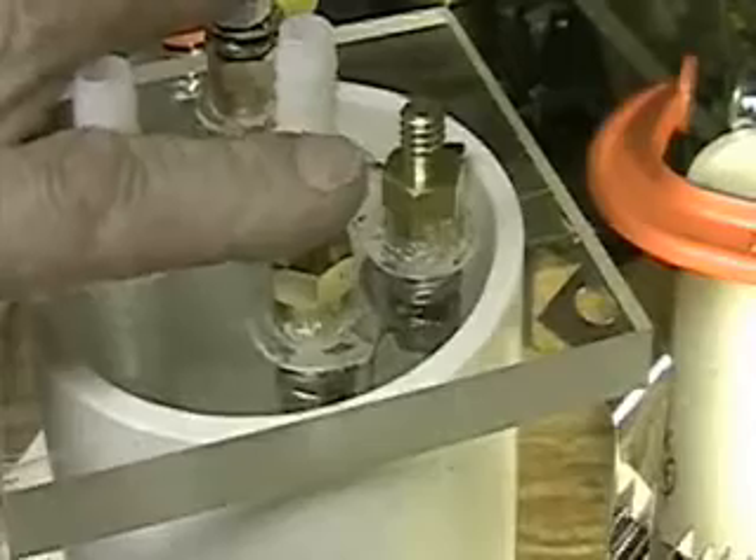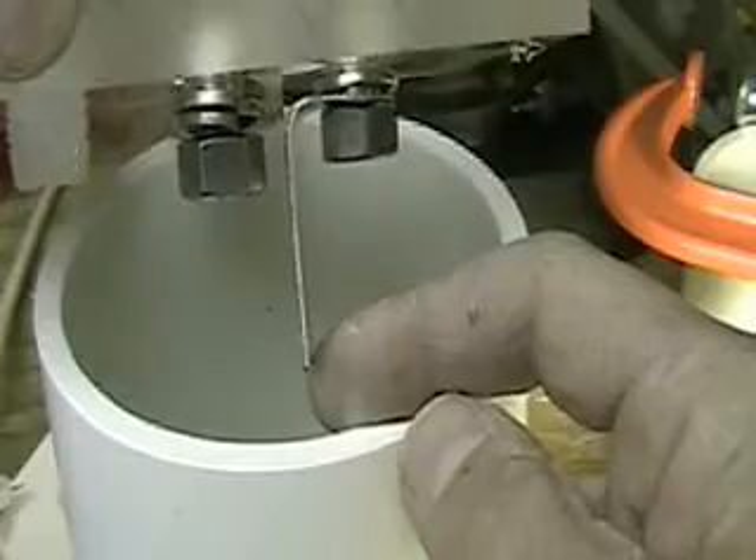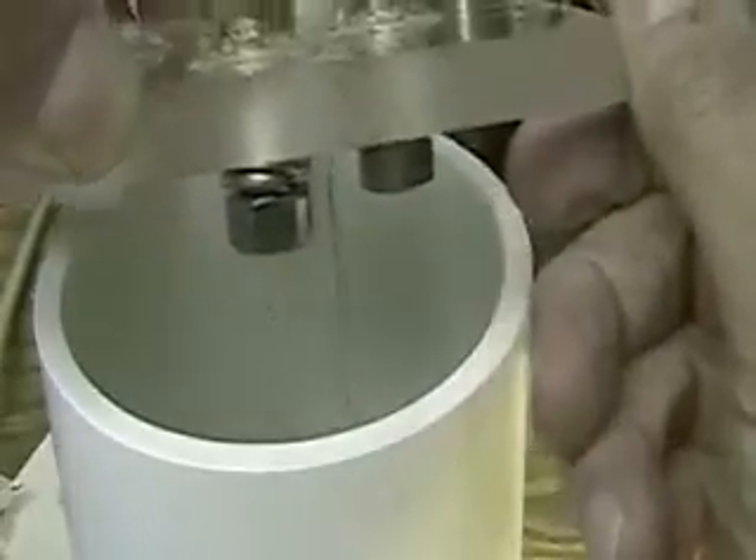This is the top of the cell. The Focus has a unique top in which the cell itself goes across these two electrodes, and the third electrode will go in common with one of these, which will give you the reading of whether the water height is correct. You can see that here — the way the plate is. This plate here reaches down, touches the water or electrolyte, and tells you when to fill it up.